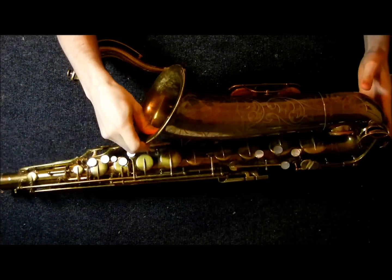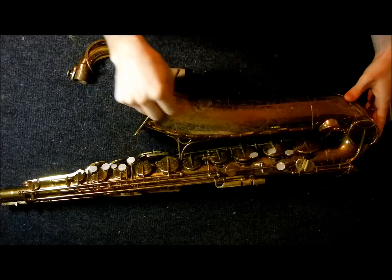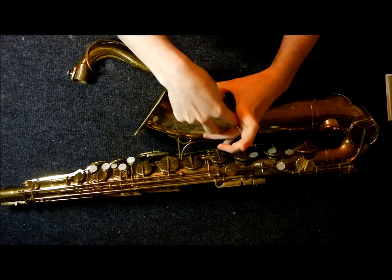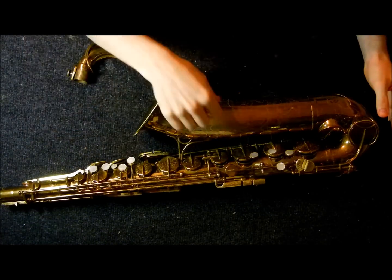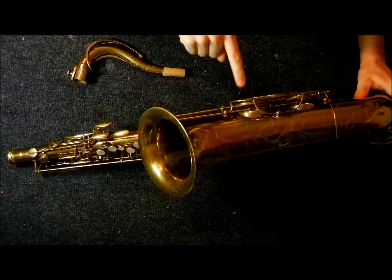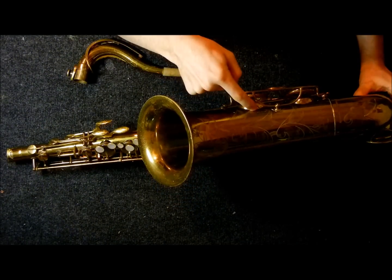holes. Now, most saxophones have tone holes that are pulled out of the body. They cut a little hole, and then they put a ball inside, and they pull it out inside of a form, and it presses the walls against the form, and the ball comes out, and they end up with a tone hole. They level it, got a tone hole that's part of the body. Martins, on the other hand, have a hole cut into the body, and then these tone holes, which are separate pieces, are soft soldered on.